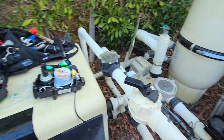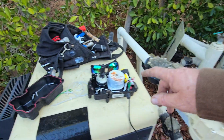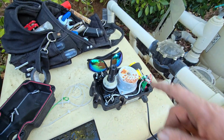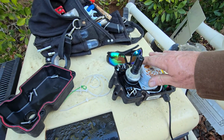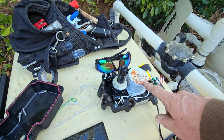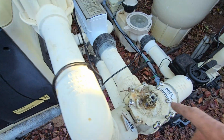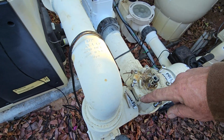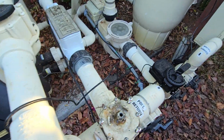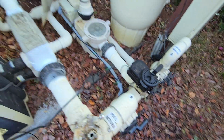So what I came over here and found is that this actuator, which I replaced like 2 years ago, perhaps you've even seen the video on my channel. Ooh, wow, that motor is really hot. There's been a fail here at the actuator, and so it's turning the valve to drain the spa or to return to the pool when they put it in spa. So yeah, it's no good.